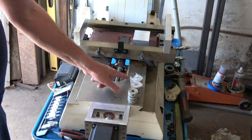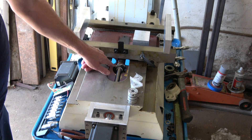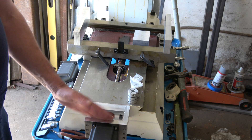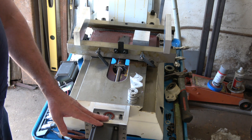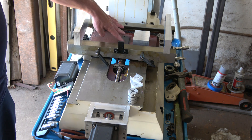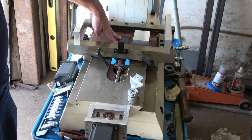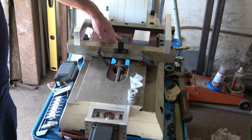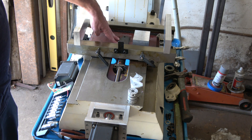The other thing we're going to have to do is this is going to be notched out to clear the ball screw nut so I can get my Y-axis travel out this way farther. Gonna have to mill this down — this pad in here — because there's not a whole lot of clearance between the saddle and the table. That's about a good eighth inch up, so I have to cut that out.